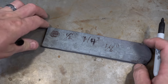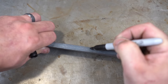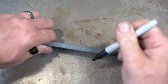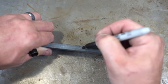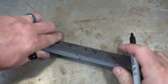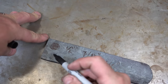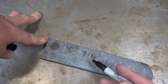The other tip is you only want to go a third of the way through the billet, because you do not want to risk the holes touching each other on either side. This billet is three-eighths thick, so we're going to go an eighth of an inch maximum from each side, and we'll still have an eighth in the center. Also, set the stop on your drill press — don't try to do this by eye. Set the drill stop so you can just hit the drill press all over the place and not worry about how deep you're going.